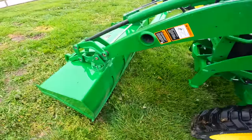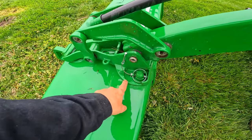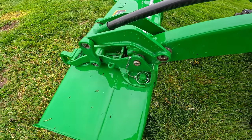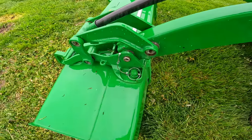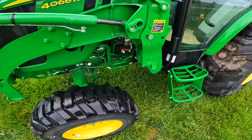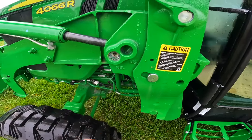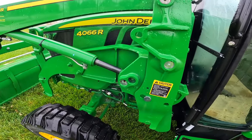So from the outside, one thing we have is the John Deere quick attach bucket. I personally prefer this to the skid steer quick attach – I think this is better. I also am slightly resentful that I can't use my skid steer attachments on it. So even though I think this is better, I think they should switch and make skid steer quick attach. They have non-self-leveling or self-leveling loaders – this same frame can be made into either. On my tractor, the self-leveling loader lifts more, but on this tractor, it lifts less.